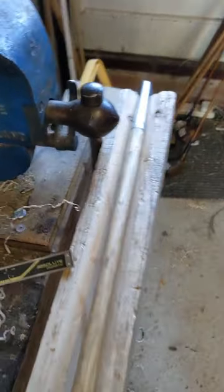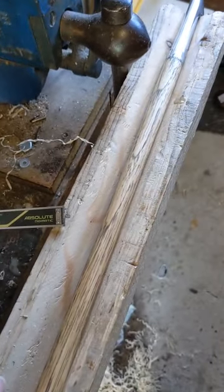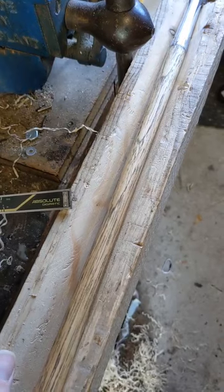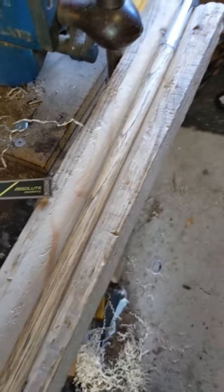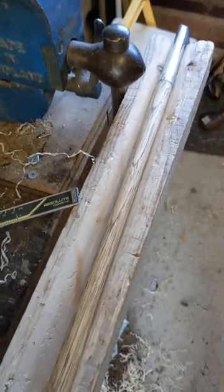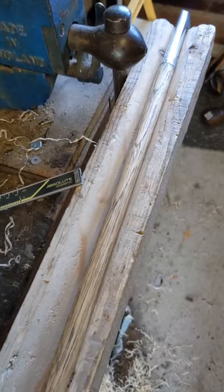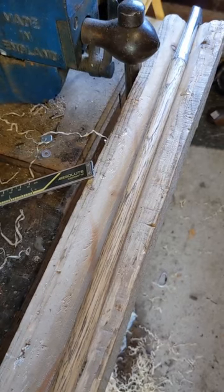What he says is they actually, rather than using pure bitumen, as I'm doing here, had a jar with tar in it, which is effectively bitumen, and then he said they put rusty nails in it as well, and they put vinegar, I think was the recipe that they used to make their stain. But people have come up with different ideas. I mean, some people just use a proprietary oil-based stain right out of the can. I've tried that myself, but this is my favourite technique, personally.